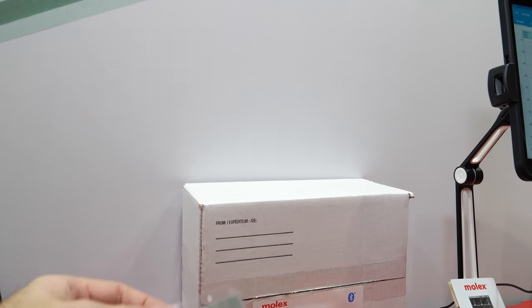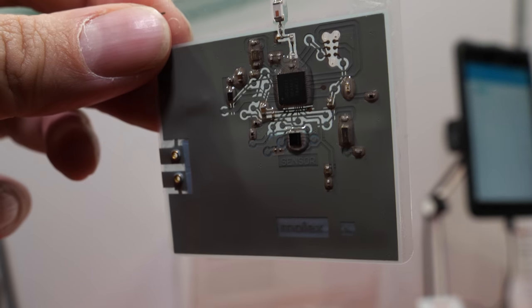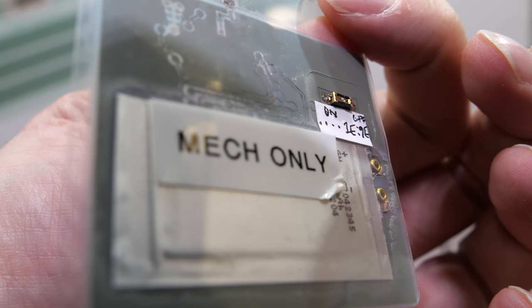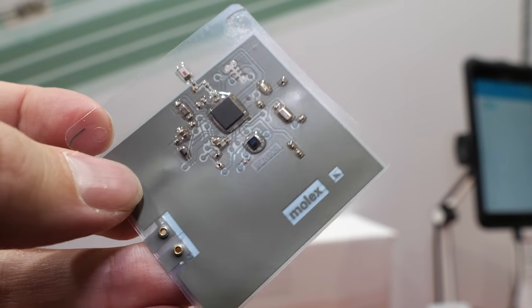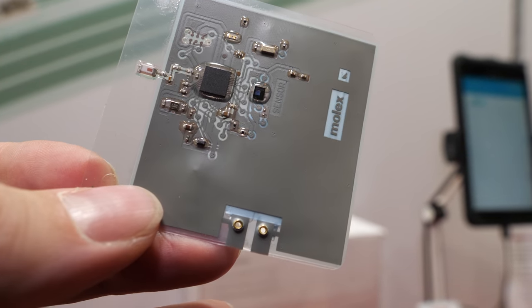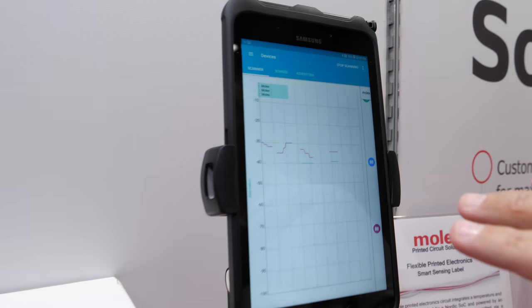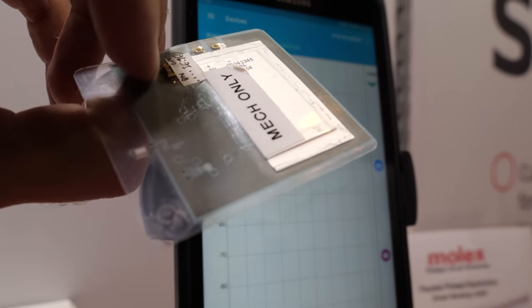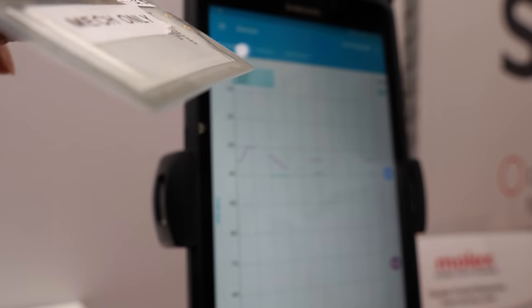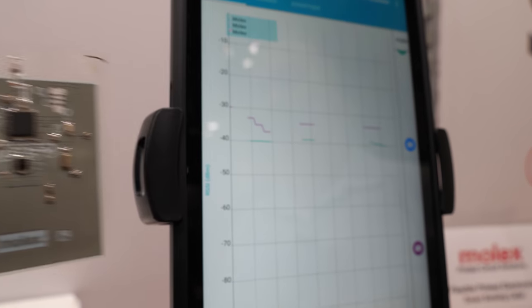What's this one? This is a Bluetooth temperature and pressure sensor built on our flexible circuitry. It was originally designed on a PC board — we converted it to silver flex, and it is actively monitoring temperature and pressure and transmitting it via Bluetooth to our tablet here. Is this a flexible battery also? That is a flexible battery — we get that with a partner. We develop some batteries ourselves but also use ones from partners and integrate them into the circuitry.